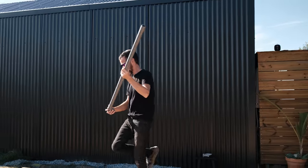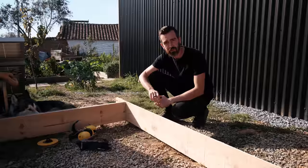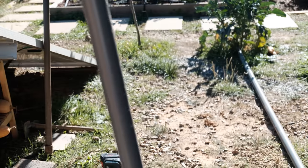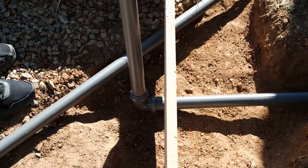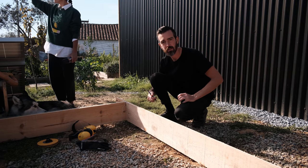I spoke with Blocken last night because they wanted to give us a hole in the bottom track for us to pass the electrical conduit. So we already set a place for it. It's gonna be 40 centimeters from the edge of the slab. So I'm gonna mark it here. That way we know that here we will need to leave a conduit. The actual wall section will come with a slot in it for us to pass the conduit.